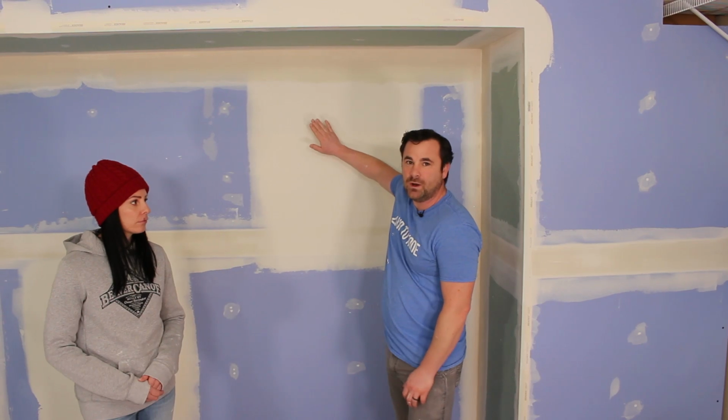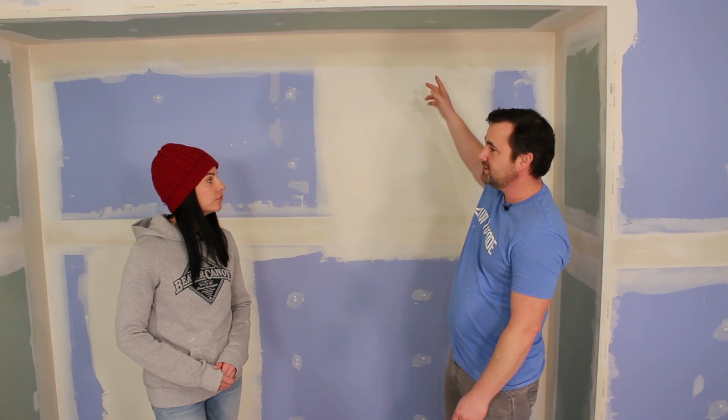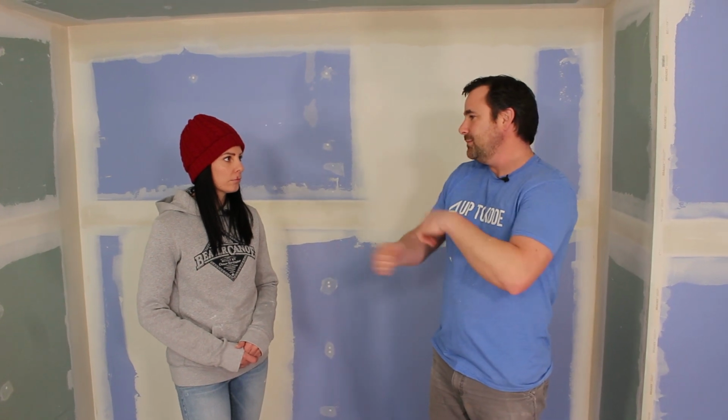Keep it like that. One thing to keep in mind with those angles is not to do it too prematurely. Like even today, we coated those over top of just one coat on our butt joint. The ideal situation is to do it after the second coat on the butts. But you also need 2 or 3 days of drying time so that you can hit the other side of the angle. So the next video will be video 8, where we do the first coat on the beads. Once that's dry, all our drying time is cut down to a fraction of what it is now, and everything speeds up really quick. So I wanted to get those angles coated now so that when we do our second coat, it's just bing, bang, boom, done, ready to sand. So there's a little bit of massaging with the order you want to do for yourself at home. I'm just trying to give you all the information that I can.